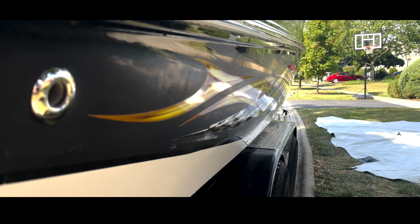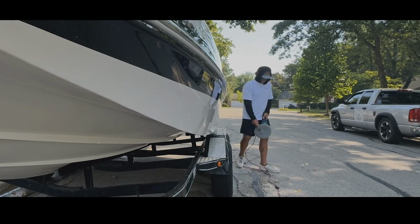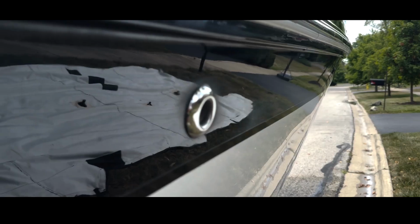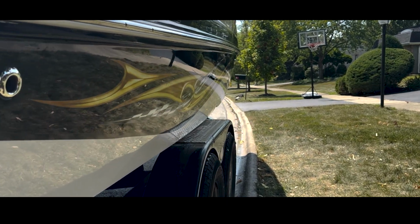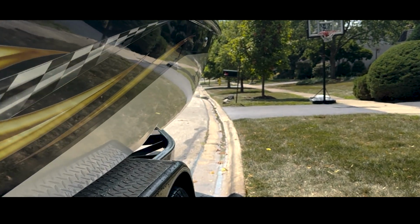Black gel coat below rub rail. I need to be really careful with pressing too hard around these stickers, while also cutting hard enough to remove deep oxidation. Bleed back is a real thing on dark colored gel coat, and keeping the boat constantly washed and dried allows you to see spots you may need to readdress. I've had to recut this section of the boat to really match the shine on the top sides to make sure the oxidation is completely removed.